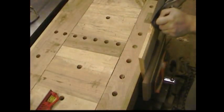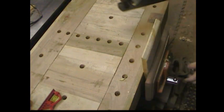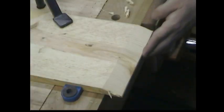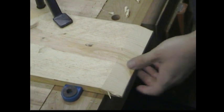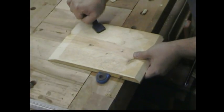So we'll see how it works out. I don't remember exactly how I saw this done, but it seems to me the final thickness of the edge, which I marked with my marking gauge, is key. I start each edge by planing a steep bevel up to that line. Then I lay it flat on the bench and start working it to the angle that I really want. I don't hold a protractor up to guess the angle — I just go with the width of my plane and get the first one done, then try to match the other ones to that.